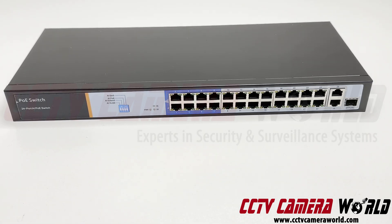The most important feature is that the first eight ports can be switched on to extended PoE mode. Those are the eight ports numbered one through eight with the blue border. They're able to send PoE power up to six watts per device, up to 250 meters away.